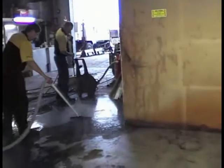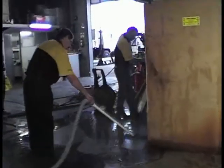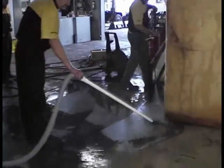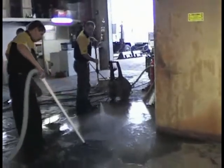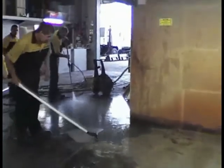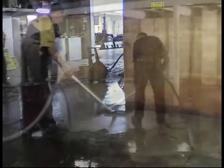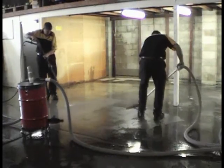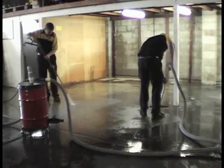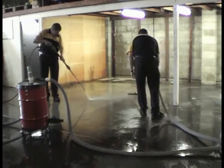In conjunction with a high-pressure water cleaner, watch as the Hilton assists in cleaning a filthy, greasy workshop floor. The Hilton vacuum, when used with its optional cyclonic liquid separator, recovers the dirty oil-laden water so well that at the end of the job, the floor surface was left only damp. In fact, it was dry and ready to coat with workshop-grade paint in just 1 hour.